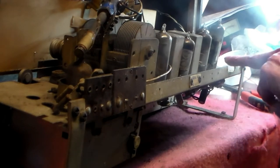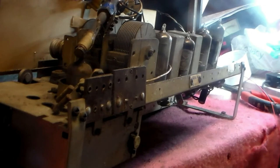First of all, over here, don't touch it while it's switched on, for heaven's sake, is the AC or DC switch here. This set works between 200 and 250 volts. Now, most areas today of mains in this country operate on 230 or 240 volts, so always go for 250. You might find it turned down. It was a common trick in the day, if the valves were on the way out, to take it down to brighten them up a bit, so something to look for.